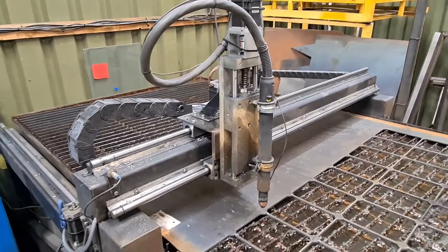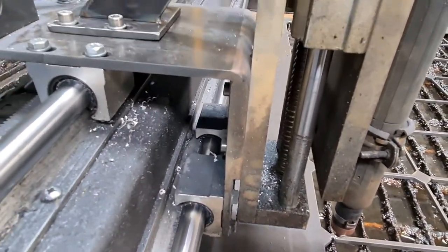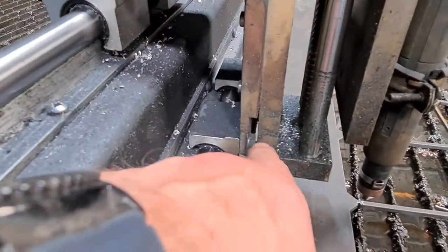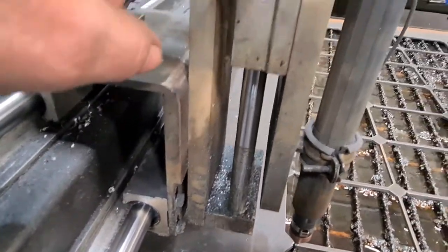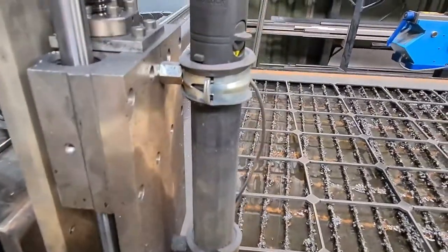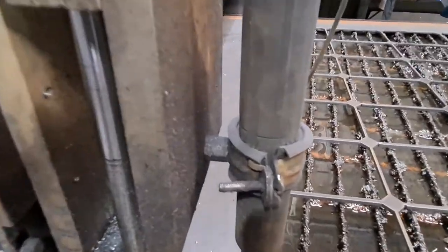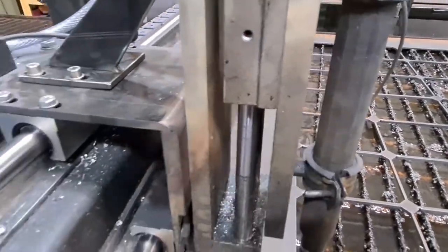Now, that mounting plate is made out of six mil and is at a right angle. There's a double plate here to space it off for these bolts down here. There's obviously no play in this — we checked those bearings, they're all tight, so everything is fine there. There's obviously no play in the torch holder because that's rubber clamps. I thought it might have been the rubber too loose; we've done those up, nice tight squeeze tight, so there's nothing there.